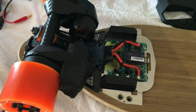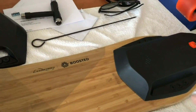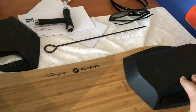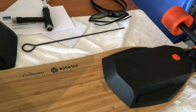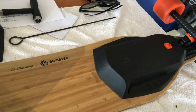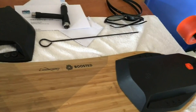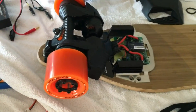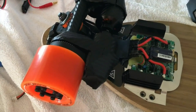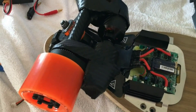Because in my calculations shown in the screenshot, I've done it at 43.2 volts, but this pack starts to decrease pretty much after you ride it up one hill, which means your top speed is limited. I've ridden this and the top speed really doesn't get limited until it's probably on about 30% charge, which means I really say it's about a 220 KV motor, giving a top speed of about 22 miles per hour.